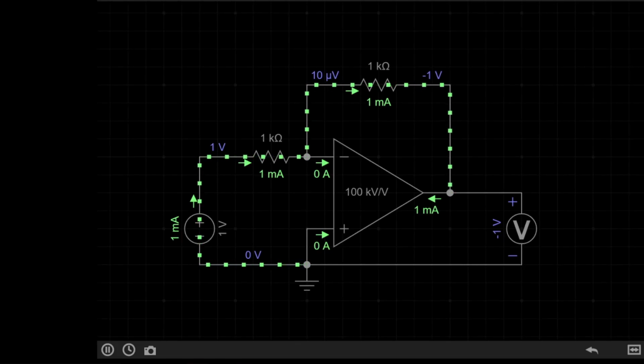Hi, this video will explain how to make an op-amp, or operational amplifier, work as either an inverting or non-inverting voltage amplifier. If you're not familiar with op-amps and would like a general overview, then there is a video in the description below. But to summarise, an op-amp's goal is to make the output the difference between its two inputs. This effect can be used in various ways by adding different components across its terminals, usually resistors.